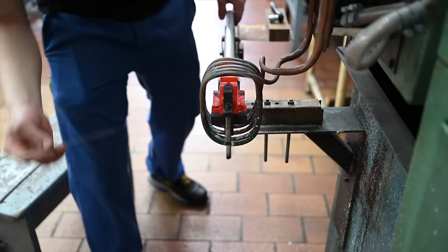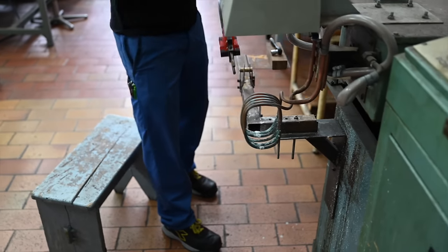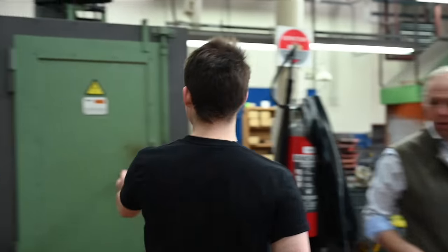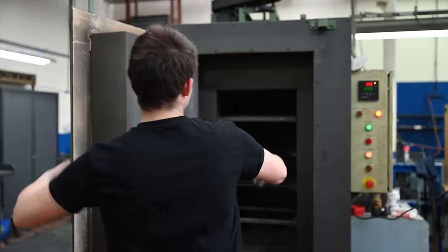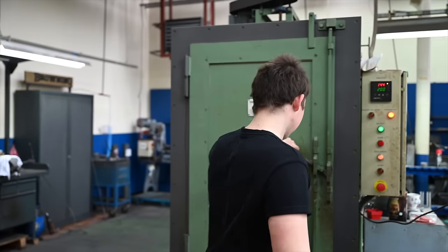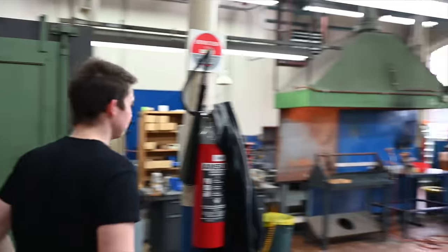So the plugs in the end of the barrel, they're keeping the barrels together? For the convergence, yeah. Wow. As I said, the oven is just to cool the material, not too fast, to avoid any hardening, basically. Because we want the barrel to stay stiff. When you shoot, the barrel has an undulation, in fact, so you don't want something too hard.